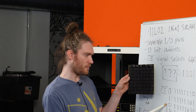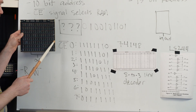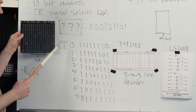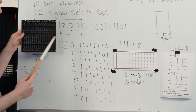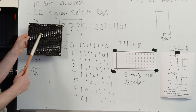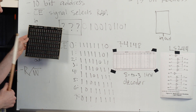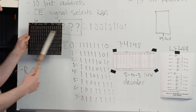For the third chip-enable, that row's chip-enable goes low while the previous row goes high. For the fourth, fifth, sixth, seventh, and final eighth rows, each respective row's chip-enable goes low while all the rest remain high. That's how the computer in the EMT accesses each row of these RAM chips.